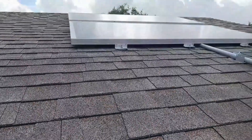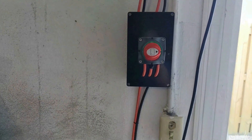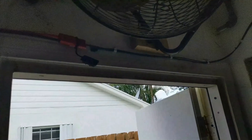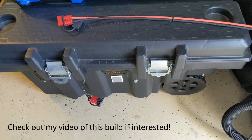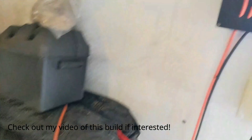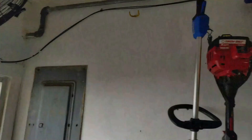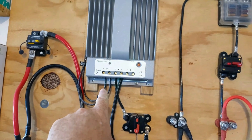Starting at the beginning: I have two 315-watt solar panels. They come down and feed into my garage via a switch through the wall. The switch allows me to split the power coming in from those panels either to output 2, which goes over to my solar freezer system, or to output 1, which I use to top off my 3,360-watt portable solar generator. If both are close to topped off, I put it on 1-2 and it splits the feed to charge both at the same time. The leads then feed into my MPPT charge controller.